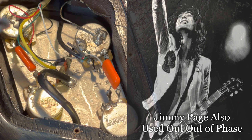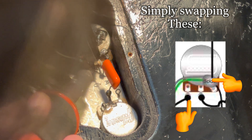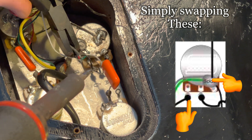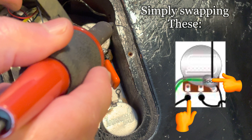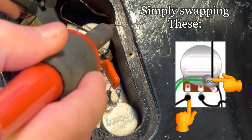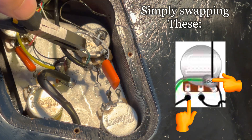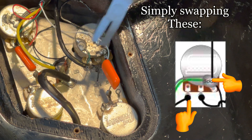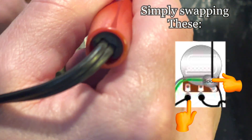Let's get to work and carefully remove these two components. We'll take this one off the lug — that one came off pretty easy. So that's the black hot wire. You've got to be careful with all these wires in here to not touch them with the side of the soldering iron, otherwise you're going to be in for a bigger job. That white wire coming from the three-way switch is really getting in the way here.